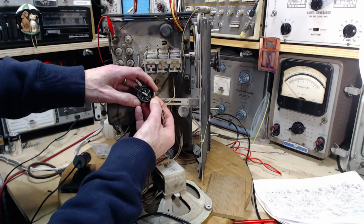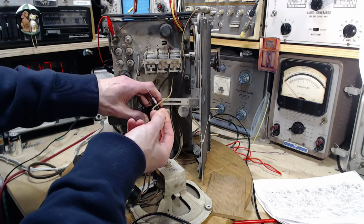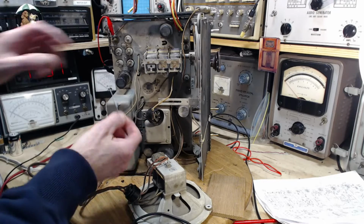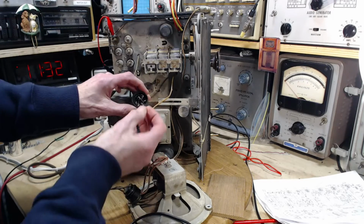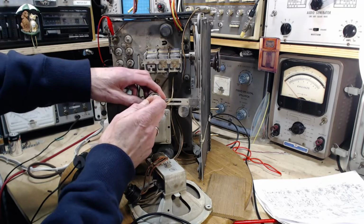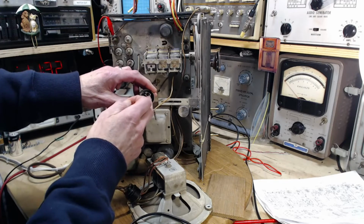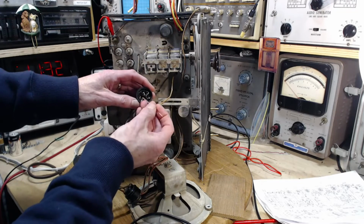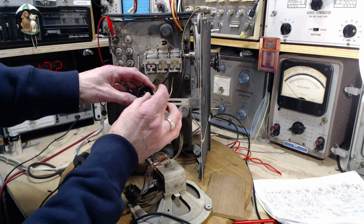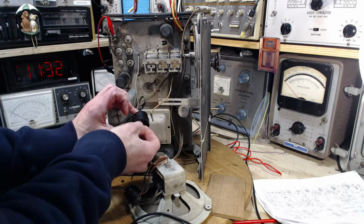So that would sit right in there. You know, I could do it. And sometimes what you find is these resistors actually pushed through the back, sticking out the back here. That's an interesting way of doing it. It gets the resistor farther away from the heat. It's not just the heat of the magic eye tube. This is sitting right next to that big rectifier tube cooking too. So the only thing we can do to cool this guy down, stick them right in like that. Have them come out the end.